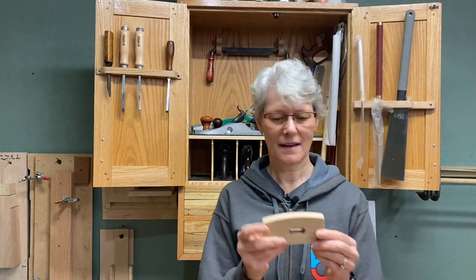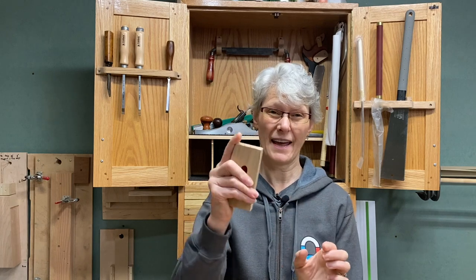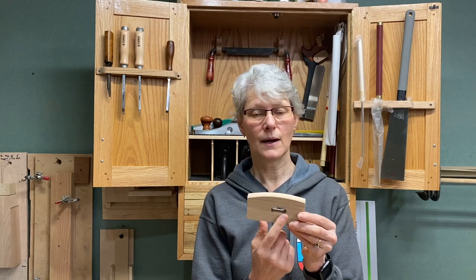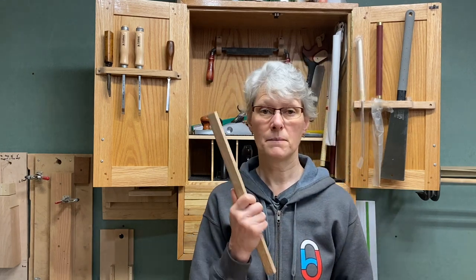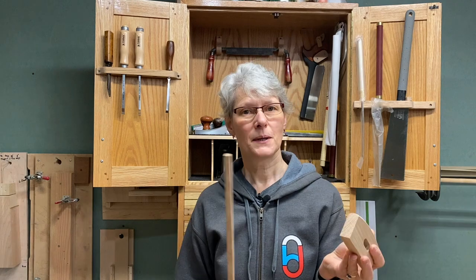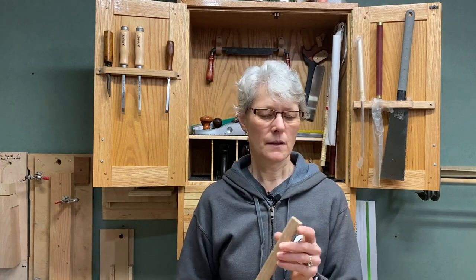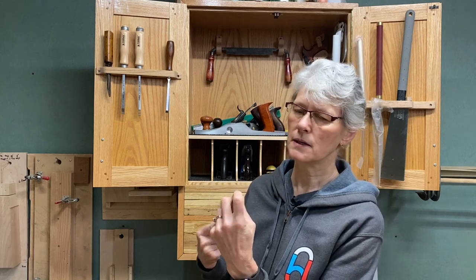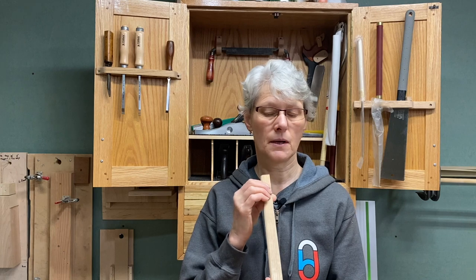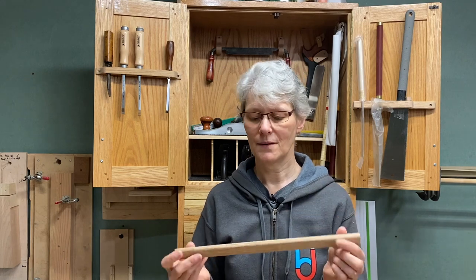To make this straight line block, it's really quite simple. It's just a block of wood that's maybe three to four inches wide — about right for a hand. It has a mortise routed into the center for holding the beam. The beam itself you can hand make quite easily. I used my hand plane and a jig to plane it down to a thickness that fits into the fence really well all the way through. The end of this is cut square. You also want the beam quarter sawn, going as straight across as possible — so you want the ray fleck, for example on this oak, on the side of the beam. That ensures the beam stays straight as an arrow for its whole life.